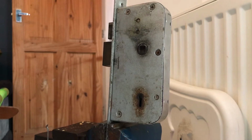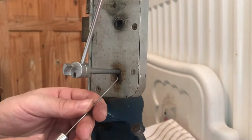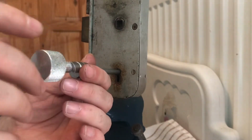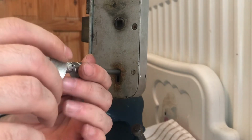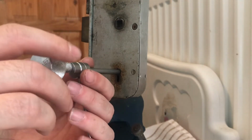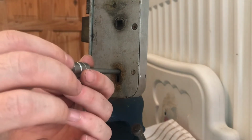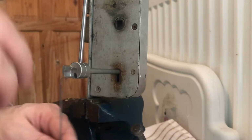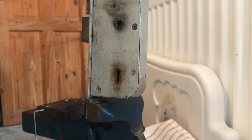We're just going to do one at a time. So we'll change number 5. Test it again. Let's go. Test number 1. That's been loose all along. Feel it, just watch it and hear it now. Resistance, smoothness. So we're going to say number 1 has to go up just the 1 height. It was on a number 9, so put in a number 8 and see how that reacts now.